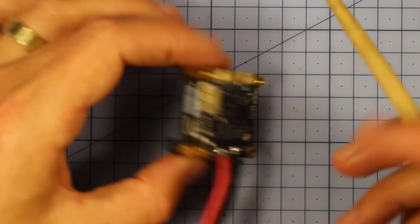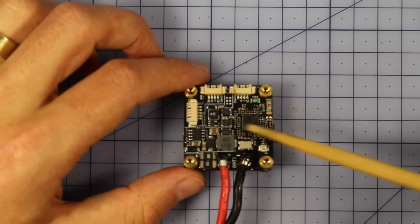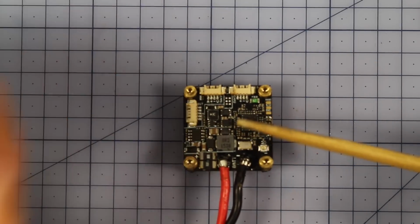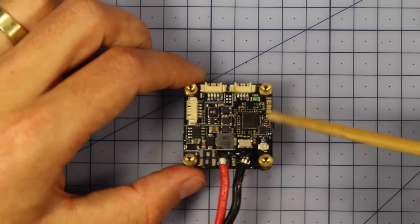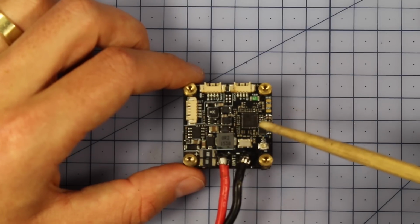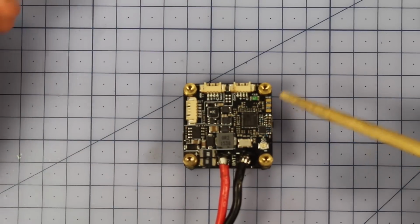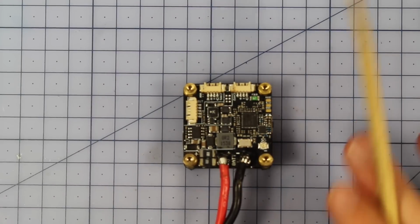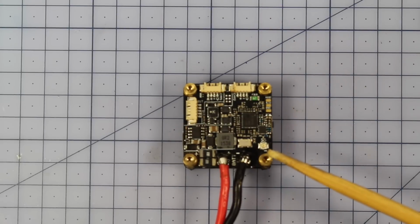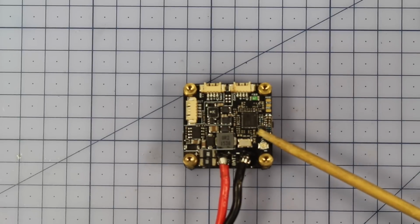So let's start at the bottom and talk about our VTX, and we'll work our way up to the flight controller. Now the reason this VTX and OSD combo is so special is because it actually gives you a few options in the OSD when you're setting up the quad itself on how to change its channels. So you can go into the OSD and you can select things like what power it's going to be, what band it's going to be on, what channel, a whole bunch of different options on your VTX straight from your radio. So no longer do you need to fiddle with dip switches or put in a different VTX if you're going to races or push some buttons or anything like that. The whole thing can be configured straight from your radio when you boot your quad on. So I really, really love that addition, and I think it makes setting up things for races, or no matter where you're going, super easy.